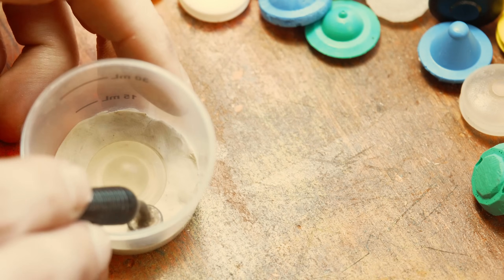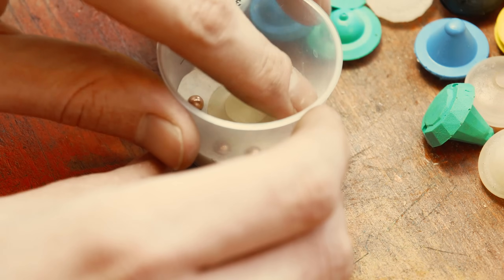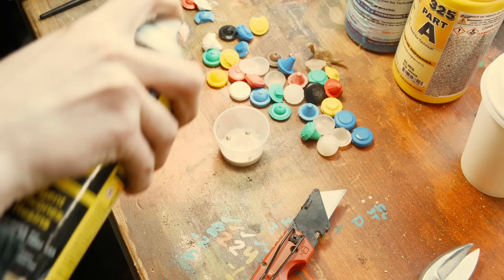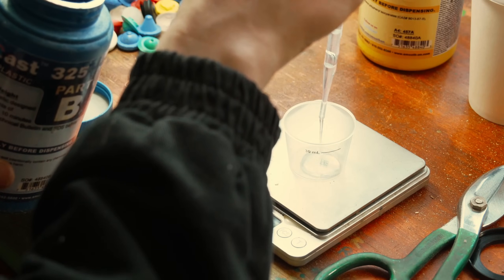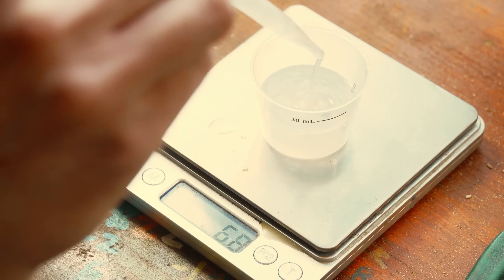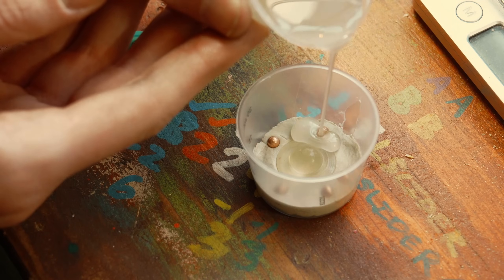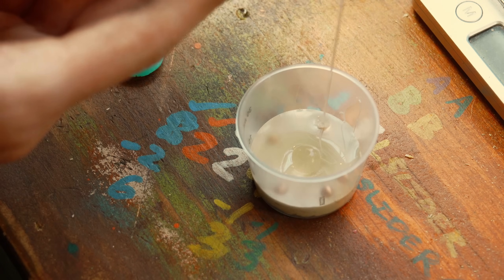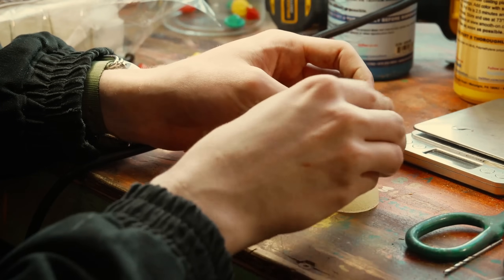This one is going to be a two-part mold, top and bottom. I added some brass BBs as alignment marks for the two halves so they'll always slot together in the same spot. Then I just spray the part with mold release so that I can pour the resin overtop it. I like to use eyedroppers for small batches of resin because it's really hard to get the ratios exactly right. In theory, if this mold works how I'm expecting it to, it should function better for injection molding than the flexible silicone did. But there's a lot that could go wrong here.